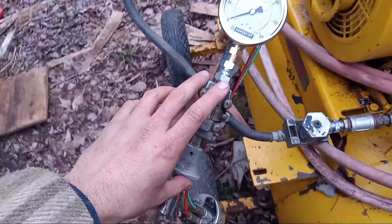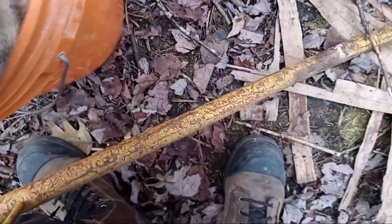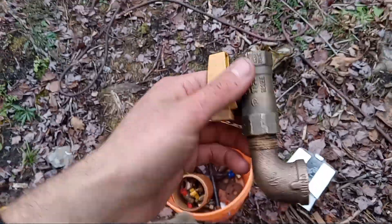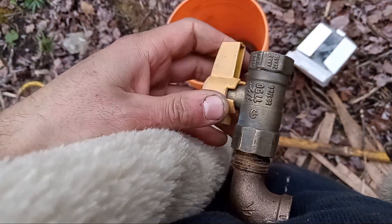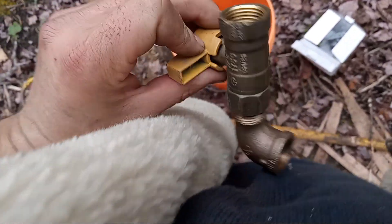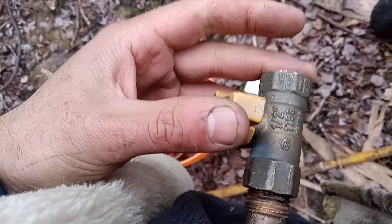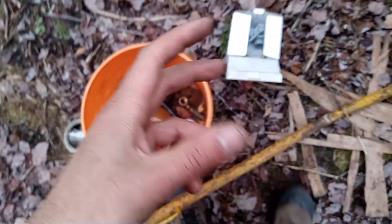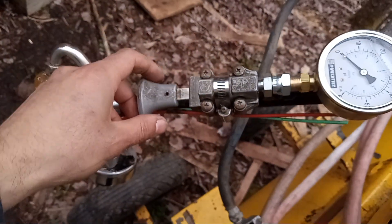This is very important: if I were to just have a valve that simply opens and closes — open or closed — if I close the valve there's still air in the pipe. So I have to empty that air out, and that's why you have the exhaust here. These things are a little bit more complex than a simple on/off valve. There's a little bit of a leak there — I just hand-tightened these things.